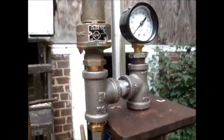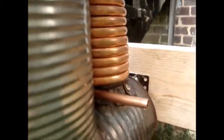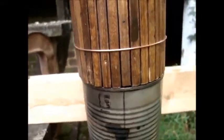Today's update: I've got the copper around the heat exchanger, where the water goes into that tube, wraps around the flue, and through into this. I adjust the flow rate with this little valve, which came off my sink — probably has lead in it. It preheats the water, which makes the boiler more efficient. This is called the header; the firebox is here; and the exchanger is the copper tubing.